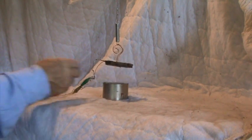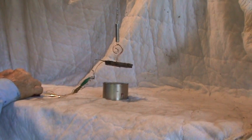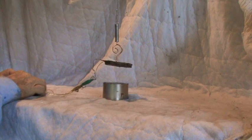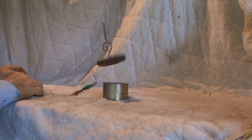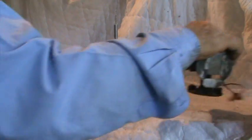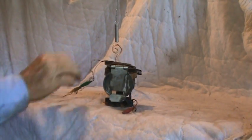I have about two and a half inches here, and I'm putting six volts. The coil is about three ohms — it pulls it down quickly. Next, I'll move to a commercially bought electromagnet and we'll see what properties it has.